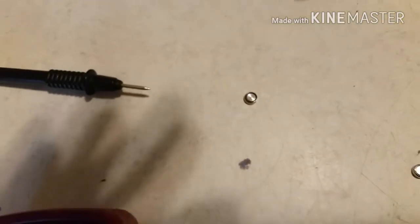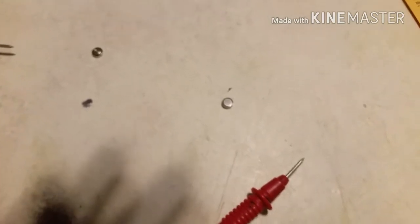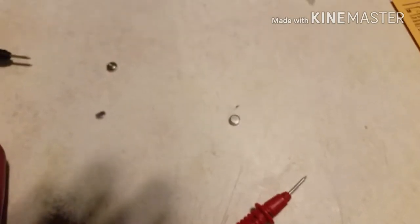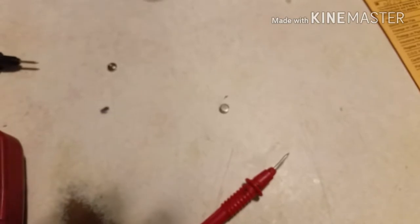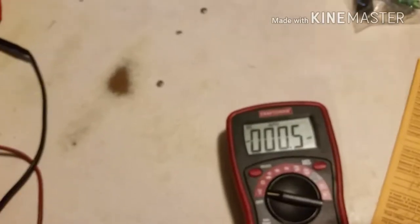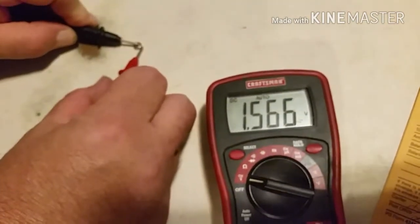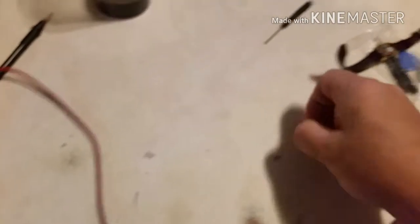The original battery I just tested came out to less than half a volt — 0.4 volts. Now we're going to check the new battery I've gotten out of the package. I have a whole case of batteries I keep on hand for repairing things, and I recommend not buying bulk cheap no-brand batteries. I buy Sony batteries now — name brand batteries seem to last quite a bit longer. Checking this brand new battery: the black negative goes in the middle on these button batteries, then you touch the red to the side. And there we go — 1.56 volts, which means this is a good battery. We're going to install the good battery into the watch, and that is our basic function on how to test a battery.